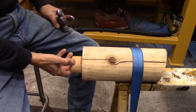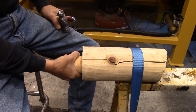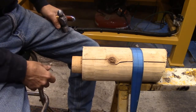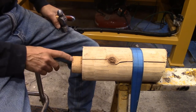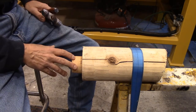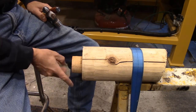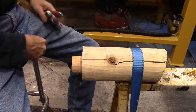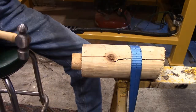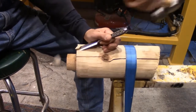As we can see, we've got our little tenon — it's sticking out and it looks just like a dowel. This is a little bigger than two inches because I think somebody borrowed my two-inch hole saw. For the sake of this example, it'll work fine. The deeper the hole saw, the better. I thought it was an inch and three quarters — it's actually like an inch and five eighths. All I did to get this out was drop a sawzall. I measured in, traced a line, went down with a sawzall, and a little donut piece came out. Now grab your favorite chisel, get comfortable, and just start chipping this stuff out.